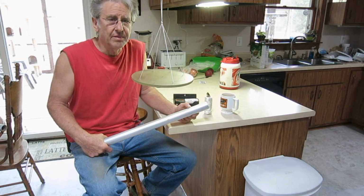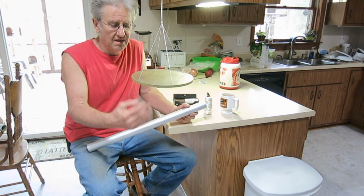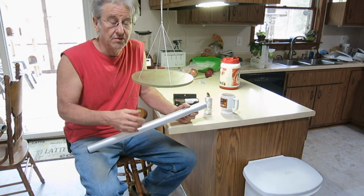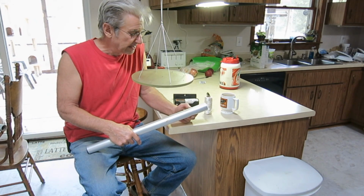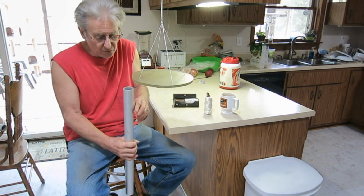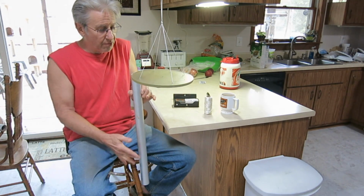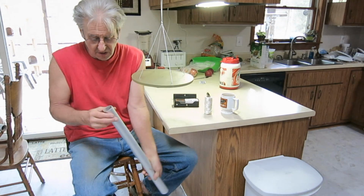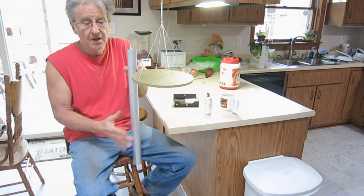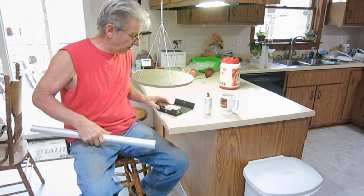All right, so I took it back. There were flat pieces of metal, like chimes, and I didn't have them tuned, so I had to retune them to make it sound like anything. The other thing about it is, when you tune it, you keep grinding it. See, I did this one on a lathe. I cut the ends of it, and you start out long, and you grind it down and cut it and cut it and cut it until your tuner reads right.